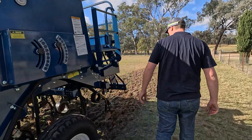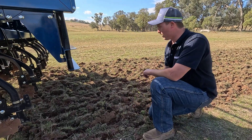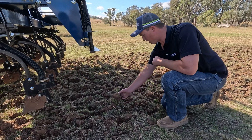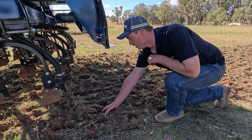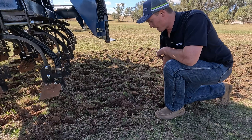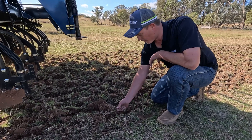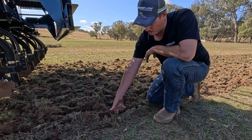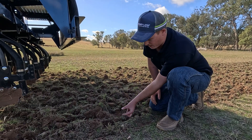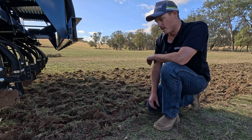We'll just have a look at how that seeding depth went. Looking at the back of the machine here, we can see that obviously being direct drilling into some existing chewed off pastures, we've probably brought up a few of those clods, which is okay. We can see that some of our seed is behind the machine there, which is really good. Now we'll just check the sowing depth of the machine — I'll just pick one of the furrows there. Keep in mind that it has lifted the ground a little bit each side, but checking with our fingers there and then that level height, we can see that that is sowing certainly over 25mm and between that 25 to 30mm that we were chasing.